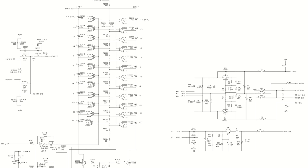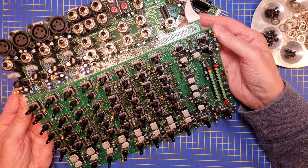As the voltage rises above the reference voltage, the comparator output goes high impedance, meaning the next comparator short-circuits the rest of the LEDs in the bar, allowing current to flow through that LED down into the minus supply, while the remaining LEDs are not lit. As the voltage rises further, more and more LEDs get current from the generator and light up, until at the top all of them are lit. This is actually very clever — with 24 LEDs, switching them individually would cause a wide range of switching currents and interference. With this constant current generator circuit, the current never changes regardless of how many LEDs are lit; it's the same all the time.